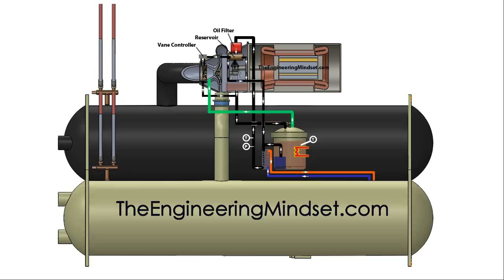This oil system should generally be checked at least once per year. The oil is inspected to make sure there is no metal accumulating, which would indicate a fault — your gears are probably wearing — and it may also require an oil change. The submersible pump inside the chamber is probably less than one kilowatt, around one horsepower or maybe 700 watts. It's not very large, though it could be bigger depending on the size of the chiller.